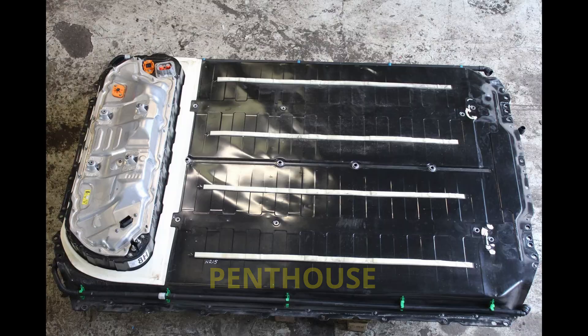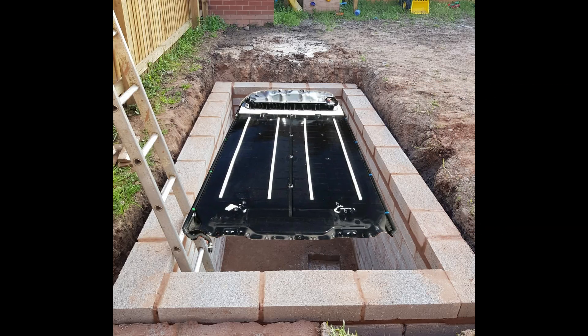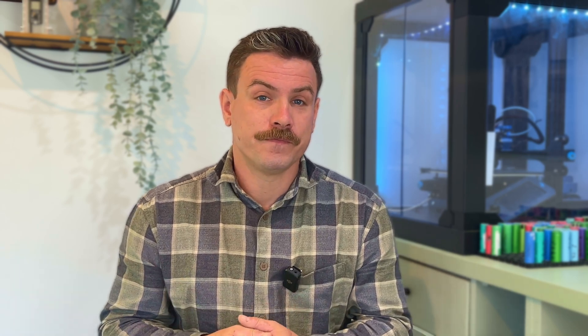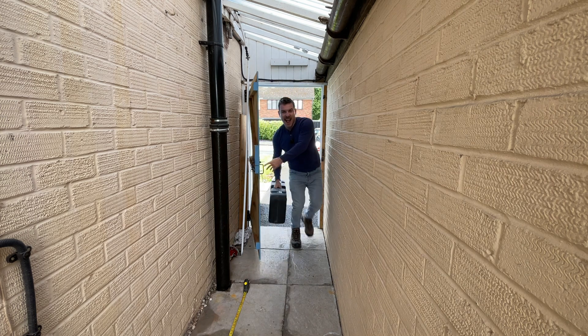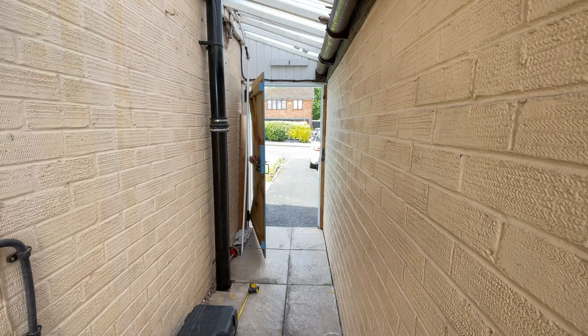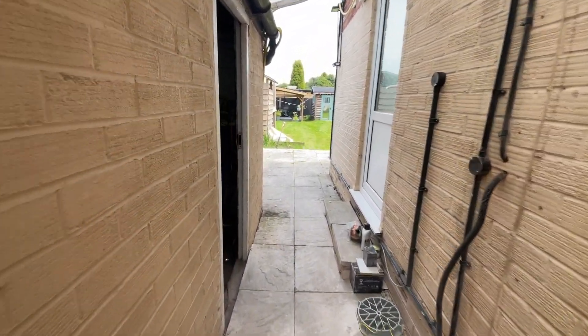Admittedly, all the connections are on top at the penthouse, and I potentially could make some sort of box around this area. But that's going to dramatically reduce the garage floor space, and even the shelves on the wall above wouldn't really be accessible without standing on the battery when I have to reach 1.4 meters in. What if we were to bury it in the front or back garden in its own little concrete chamber? Then I've got to deal with potential water ingress as well as lengthy cables to the inverter and ducting that would need to be run. The problem with our house is it's either got to go through a passageway or through the garage doors. I thought about putting it down the garden, but that would mean it would need to go on its side entirely all the way through the passageway, back down some little steps at the other side.